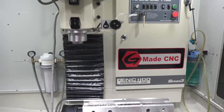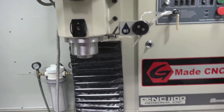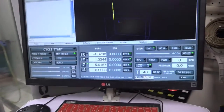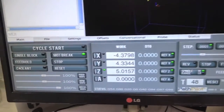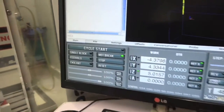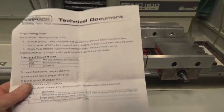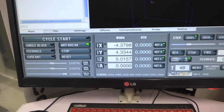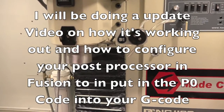Alright guys, the whole system is in. It was fairly simple — it took a lot longer making the video. I probably could have done this in about 15 minutes and had the whole thing installed. Super easy. PathPilot is pretty much configured — at least the controller is configured to work with PathPilot to run off your tool offsets. There are a few other options: wiggler mode, air blast, stuff like that, which I'm not getting into because I'm not using them — just the tip offset. In the back of the manual it explains everything and what codes to enter in your MDI, and it's that simple. I just wanted to throw this together for any of you guys that might have been interested in getting one and weren't sure what it was about. I hope it was helpful. Alright guys, take care, see you next time.